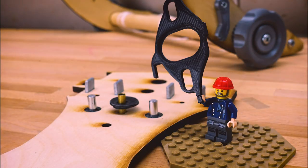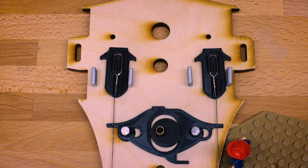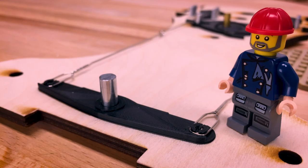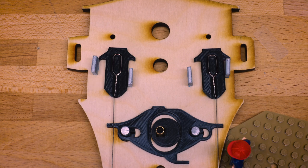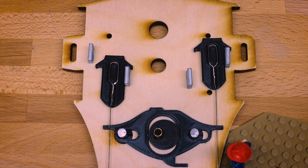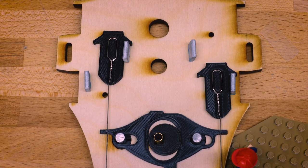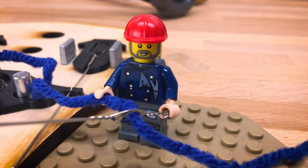We put a follower around each of the discs. Instead of raising and lowering the threads directly, these followers move these hooks left and right. This causes the hooks to engage or disengage with the lifter bars. The bottoms of these hooks are connected by a teeter-totter. By raising and lowering the bars, the loom pulls various threads up and other threads down using these wires, called heddle wires, which have an eye that each of the threads passes through.